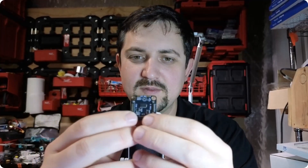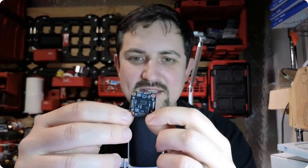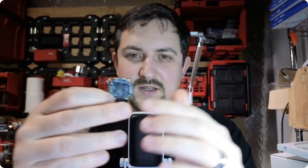So that is the CamSwitch 2 for HD Zero cameras. One important thing to consider: if you want it to work its best, you want to use the same types of cameras from the same generation — so two Micro V3 cameras, or two Nano 90 cameras, or two HD 90 cameras. That's going to be the fastest switch time. If you use different cameras it might work, but it might be slow to switch between them. Also, if you leave this powered on for a very long time — like 10 or 20 minutes — the switching time will increase, because the clock on the two cameras will drift apart from each other, and when the VTX switches between them and syncs up again, it will take a little bit longer — instead of a split second, it might take a half a second or a second depending on how far apart they've drifted.